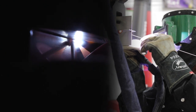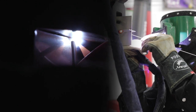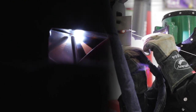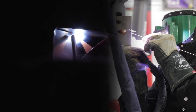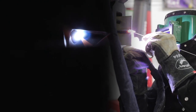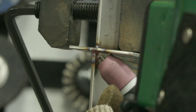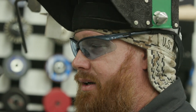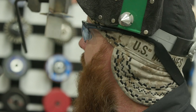It does get a little uncomfortable. It's very similar to welding flat. Once I get to the end, I'm going to start tapering off and then hold right there for that post flow — I don't even want to move. Sometimes you don't have the luxury of being able to brace yourself — you know, you're hanging on a ladder, you've got one hand up there, 40 feet in the air, whatever the case may be. We're going to go ahead and do this next pass un-propped and just show you guys the difference.